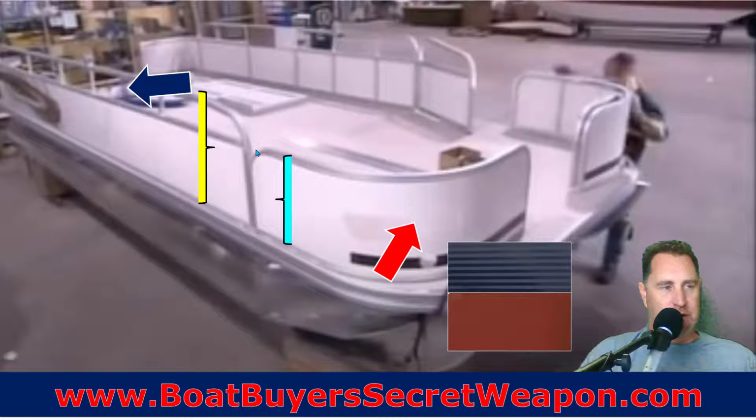Couple things about fence rails. You've got the corrugated or a flat panel. The corrugated is going to be stronger, a little bit more rigidity to it because of those ribs in it. On the other hand, if you dent it or ding it, you're not popping that baby out. It's going to be less likely to dent, but if you do get a dent, and it can happen, it's going to be harder to repair without putting a whole new fence panel in.